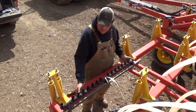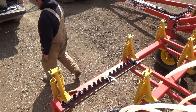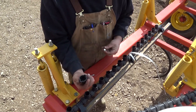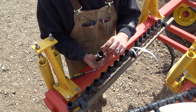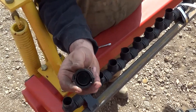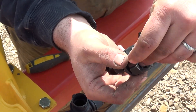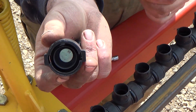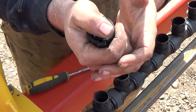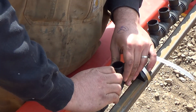The next step is to put together our orifice bodies and screw on our check valves. To put our orifices together into our caps, we grab our caps and face them upside down. We set our orifice plate in — there's a little groove that the orifice backing plate fits right into. We slide it in like that, with the number showing up so you can see your orifice. Then you go ahead and snap your check valve in. Push until you hear and feel a little bit of a snap, until they're locked in. Then go ahead and screw the caps on.